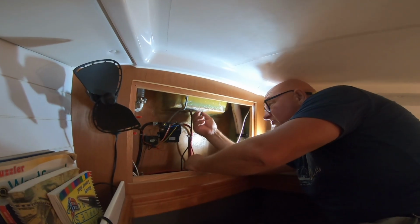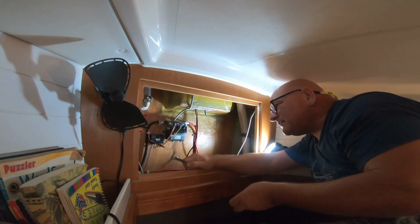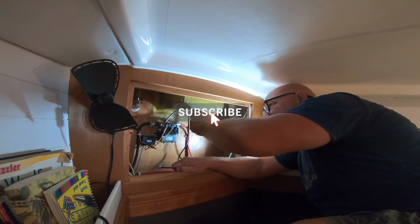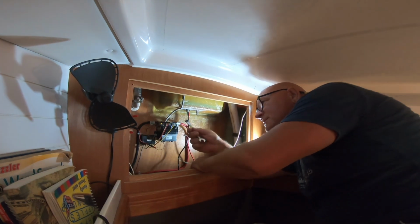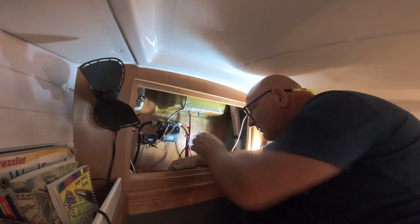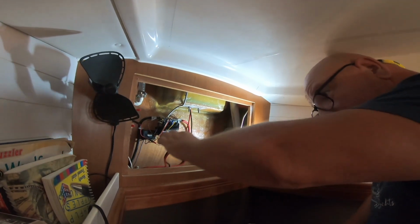Now these were nylocks and I changed the nylocks out and put lock nuts on because I didn't want the stainless bolts galling and welding up, you know, cold friction welding, because if they did, these go straight into the bottom of the windlass, you'd never get them off. So we've got two cables there, we put a loop in that. Cut them two off.